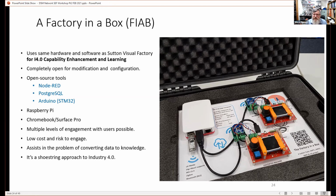But this is actually hardware that does this. And the reason for having a hardware discrete event simulator, we don't call it that, by the way, for obvious reasons, is that we can use it to generate data, which is the new bit, the bit that people aren't aware of in industry. The data generation is done on the machines, and it's collected by these little nodes that we add. And these are exactly the same overlays that we add onto our machines. They can be modified. These are particular ones for digital inputs, but that's by the by. Essentially, we piggyback onto existing controllers without having to interrupt the controllers.